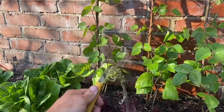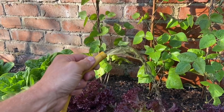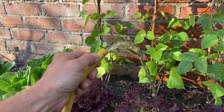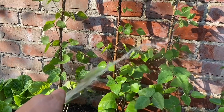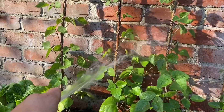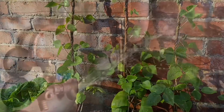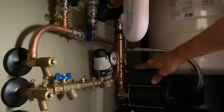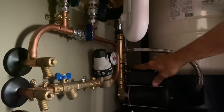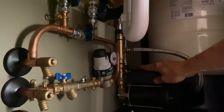Imagine the difference for your customer: if you're in the shower and the water's hitting you on the back, you'll feel it — but with this system you'll feel it a lot more, and that's why these systems are good. The pump also has a built-in bypass: if more than 12 liters per minute comes through the main, it bypasses the pump. But all pumps can only give you increased pressure — not more flow. To increase flow rate, you need to introduce storage.